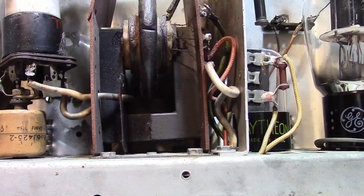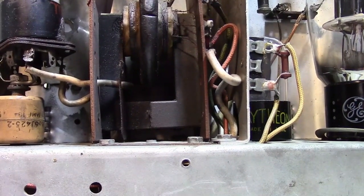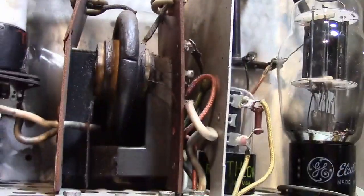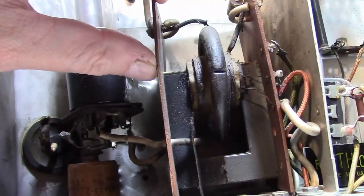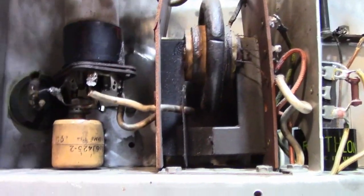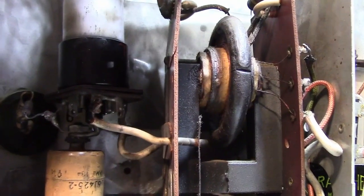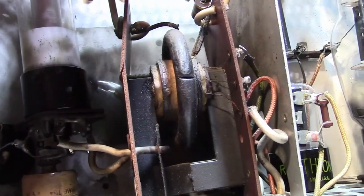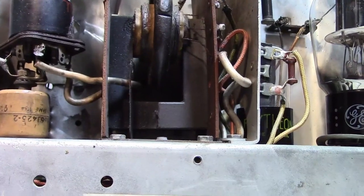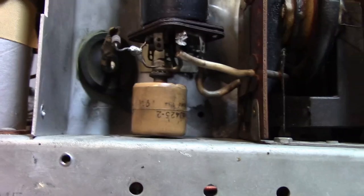I really think there's a little resonance somewhere, and components like these are there to dampen that out — you don't want anything ringing or resonating. This cracked board needs to be dealt with; I'll get some phenolic material and epoxy to reinforce it rather than just gluing and clamping. I don't think the crack is causing the problem right now. This wiring looks a bit ugly and seems to be wired incorrectly.